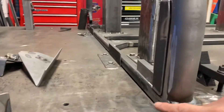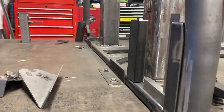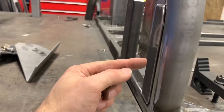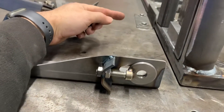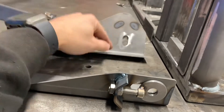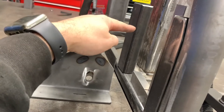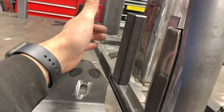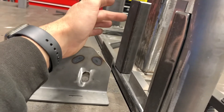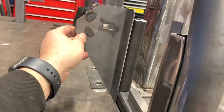I'm going to tuck these in - we'll get to the outer ones a little bit. The middle ones are going on after. What we've got to do is put this on, put a bar in with that one on it, and then that will give us our position for this one. There's still some machining work to do - we're going to drill it, put a 19mm solid steel bung in there, then drill and tap the bung. That's what allows us to bolt this one on and off.